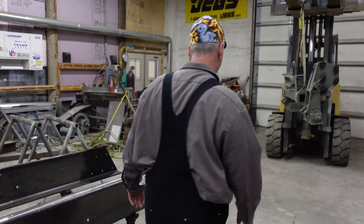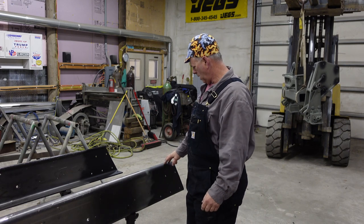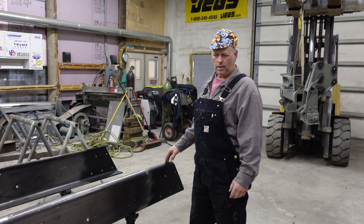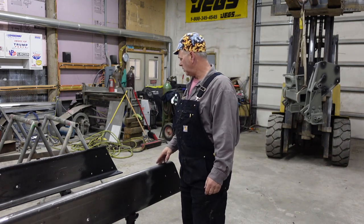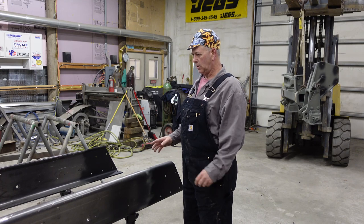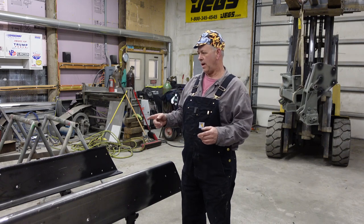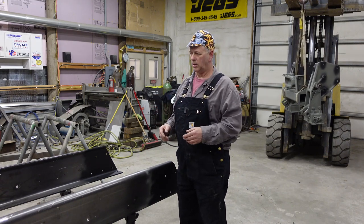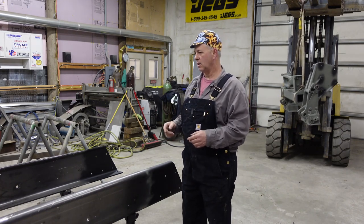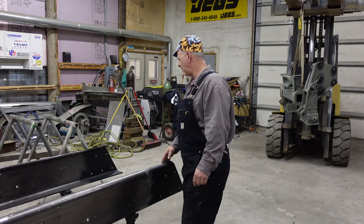All right, guys, I'm going to try to get this front horn back on here. I'm going to put the regular bolts in it, but just regular nuts on there. I consider the lock nuts a one-use deal, so I'm not going to put the lock nuts on yet. I don't know if it's the proper way, but I feel better if I do it, because these cross members all have a lot of play and adjustment slots. So I'm going to measure every one of these front to back and get the same distance in the frame rails all the way back to true things up.